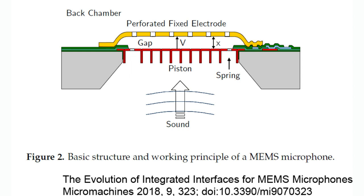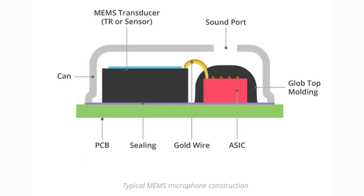You get a very tiny micro-capacitance change that can be converted to a voltage. The transducer gets placed into a metal case — this is a cutaway design — and on the right there's a little ASIC that can do some computation. There's also a sound port. The cool thing is you can pick-and-place MEMS mics; they're extremely small and thin. They're a little bit more expensive than ELECTRETs, but they're all-in-one, so that benefit outweighs the cost since you don't have that hand-soldering step.